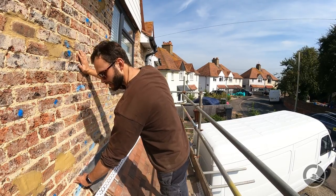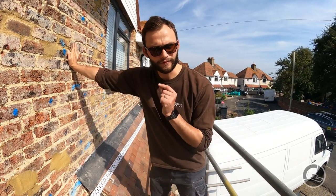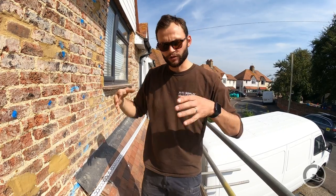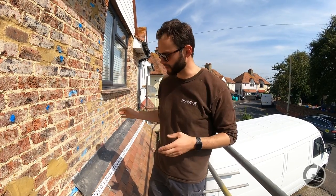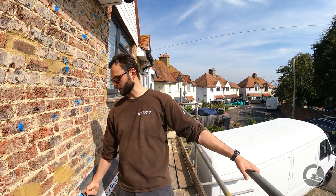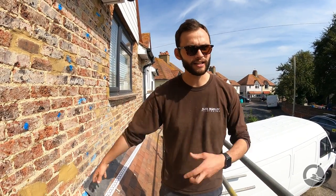When it comes to the actual fit, you want the bell cast to run about 100mm past the lead. This is a 15mm bead. We're not going to do the swooped teardrop effect — everything will run in line with the bell cast and beads straight. We'll run it past the lead and then bring the render underneath the bell cast up to the lead, so when it's finished it all looks nice and neat and square.